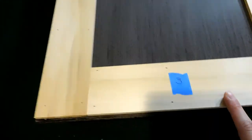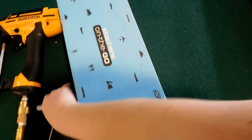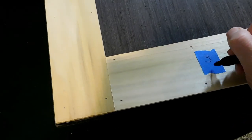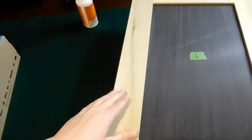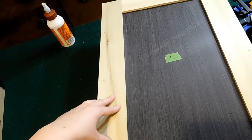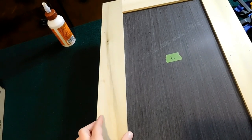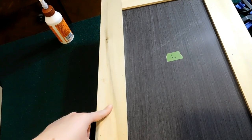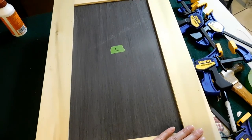When you finally glue these on, make sure you label which end is the bottom and which is the top. I use a Sharpie and just put a 'B' for bottom on the back of the cabinet door. Also, if your cabinet door handles were on the edge of either side, the great part about the two-inch wood trim is that it covers up your previous handle holes, so you don't have to worry about filling those in — you won't see them once the trim is on. The wood also covers the hinges, so keep that in mind.